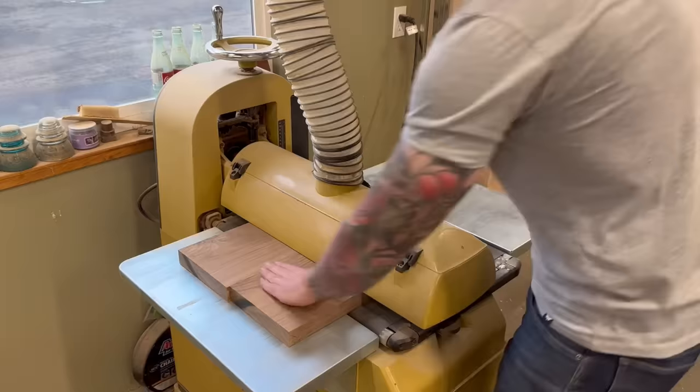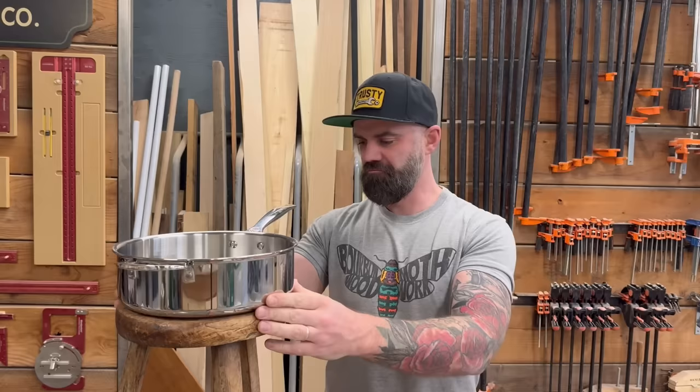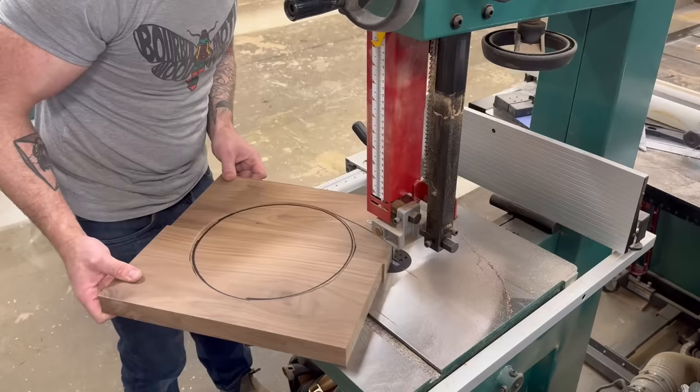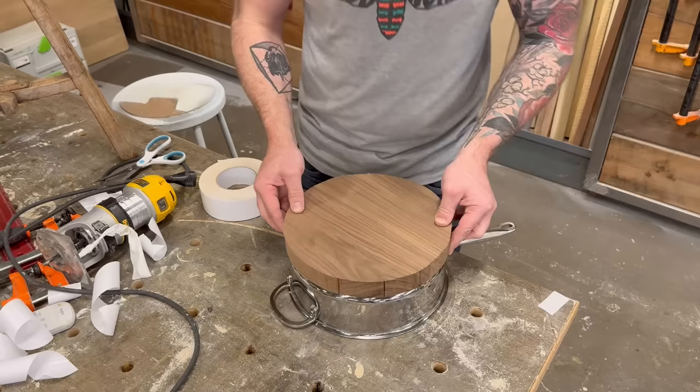I decided I'm not going to be able to put that bird's nest piece together until I'm actually ready to glue up and not take it apart. By that time my glued-up blank for the stool seat was dry — I took it out of clamps and ran it through the drum sander. I needed to cut out a circle that's 10 inches in diameter, and feeling lazy I went to my kitchen and grabbed a frying pan, because that frying pan just happens to be exactly 10 inches in diameter. All you really need to cut out a circle is a template, so I used the pan to roughly trace out the shape of my circle onto my walnut blank.